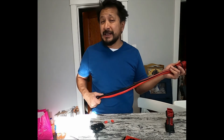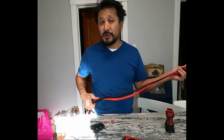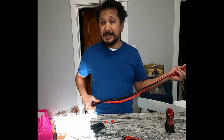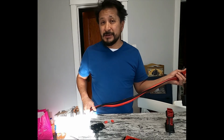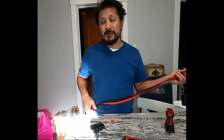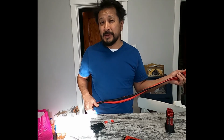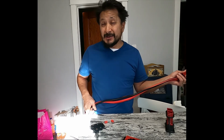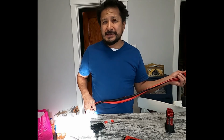Believe it or not, my Keurig heating up for 3 minutes used 1300 watts, more than 4 fish tanks and a deep freezer. Now here's the crazy thing. It heats up once for 3 minutes, and then it pours you your coffee, and it goes down to like 200 or 300 watts. But when it finishes pouring your coffee, it automatically fills up and uses 1300 watts again for 3 minutes. But then when you leave, it idles at like 4 watts.